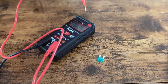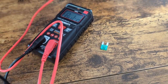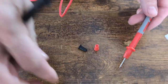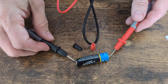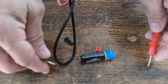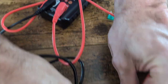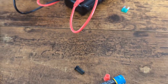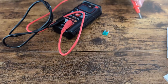So now I've got it set on auto mode. When you put it in auto mode, it should go in and check what you need. So I checked that battery again in auto mode — before I had set it to DC, but this time in auto mode it should still be 1.57. See there it is — 1.57. So this is auto mode — it's checking everything for you. If you don't know what setting to put it on, put it in auto mode and it will figure it out for you.